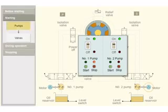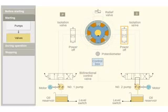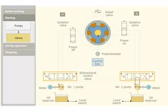The steering pump motor is started. The number 2 pump starts running. The amperage of the pump motor is checked. Electrically operated isolating valve of the running pump is kept in open position against spring pressure, and the isolating valve of the standby pump is closed. When no helm is ordered, the bidirectional control valve is in mid position.